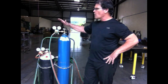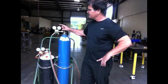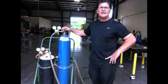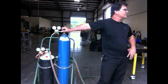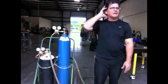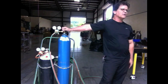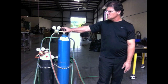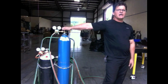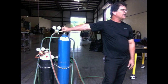There's no point in watching the needles move — it does no good. The safe thing to do is get at arm's length and look away. If for some reason it explodes, I'd rather have it hit me here than in my face. It's not going to explode because we're going to turn it on nice and slow after making sure there's no pressure in the regulator. I'm at arm's length, cracking it as slow as I can.